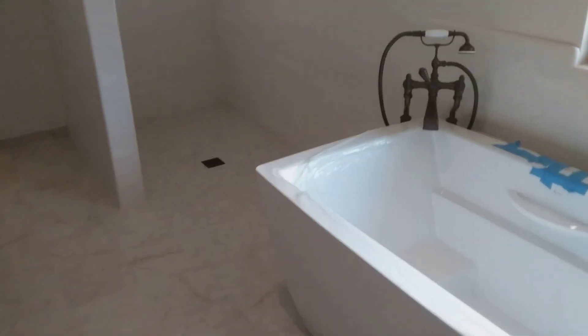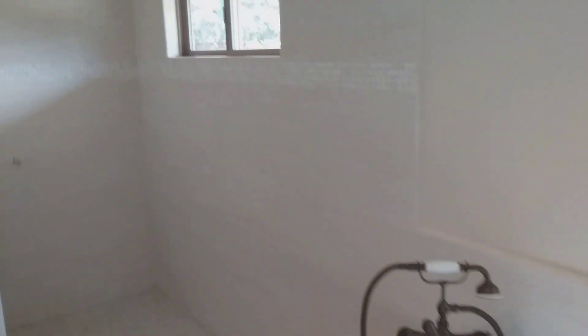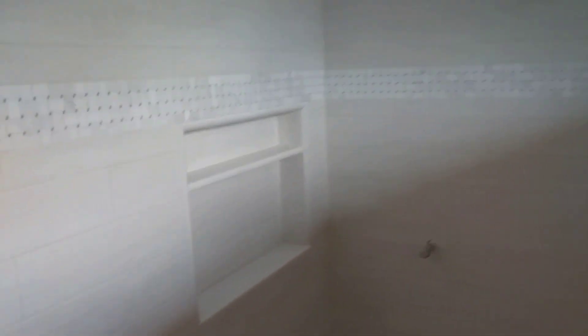All done. So by grinding that floor, it's really nice. Here's what I did — check this out. The liner goes in the soap box; custom-made shelves out of marble. The liner goes all the way around to the base, but without grinding this floor flat first, remember — see how it's a walk-in shower — this never would have kept it this low right here.